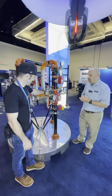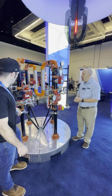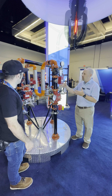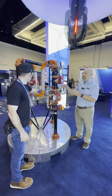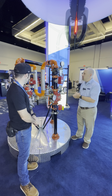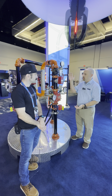I feel bad for whoever's got to put 400 PSI in a stand pipe — that's a little scary just to think about. You know, you do stand pipes a lot, and this catches my eye. This is a seismic loop — a RASCO loop. When you're dealing with a seismic condition, we're concerned about the pipes being too rigid and shaking in an earthquake. These assemblies allow the pipes to have some flexibility and not break in an earthquake. It's a new introduction to our product line. We have one-inch sizes, and it goes all the way up to, I believe, 10-inch.